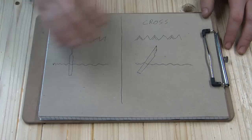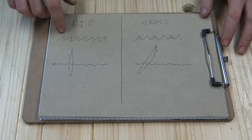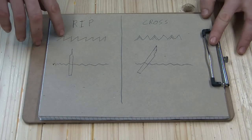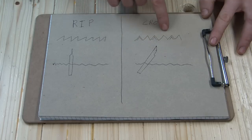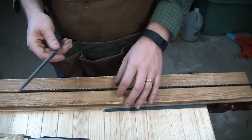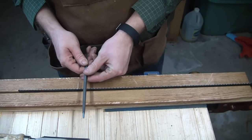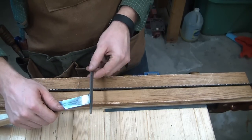Except for when you put the set in, some will be one side or the other. The other major difference is that with the rip saw, all of them are aiming forward, so as you push forward through the wood, all of the chisels are going in line and in the same direction. Towards the front of the saw they'll be flat, and towards the back they'll have an angle. Whereas with a cross-cut, they'll have the exact same angle up and down, giving you basically a knife point sticking straight up. So when you come to the blade, the major difference: with a rip, the file is running straight across, and then also it's rotated slightly to give you a chisel edge going forward. Basically, imagine you're cutting a chisel edge into the edge of every tooth.